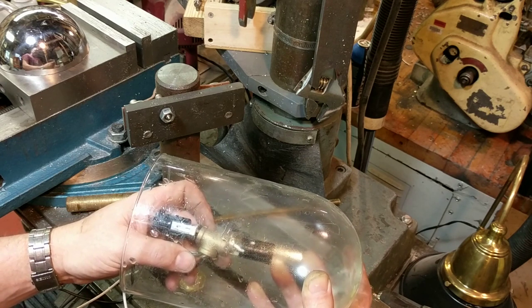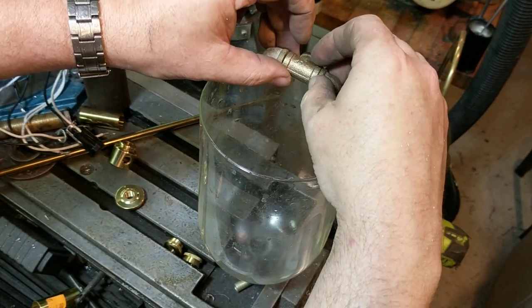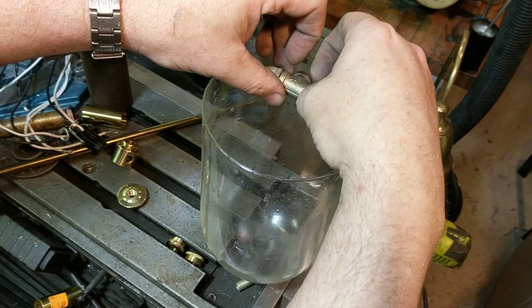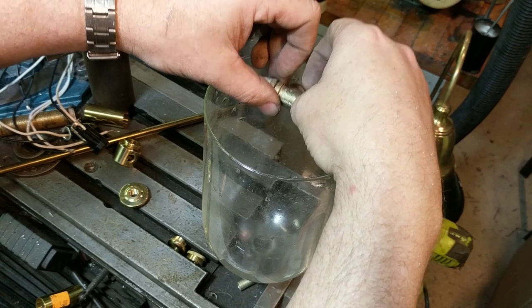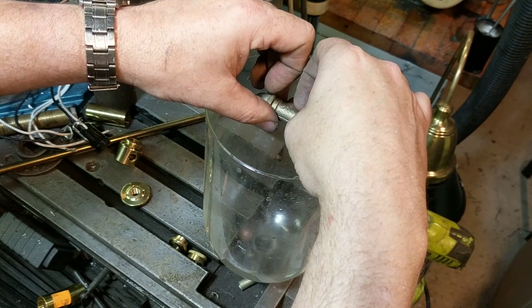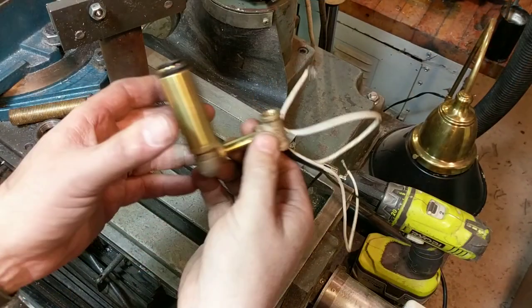I found a solution I like - I need a couple of brass close 90s or close nipples to join these L's to this T, and then those two fixtures can both point straight down. They'll be close enough together - not too close, not too far apart - about the right distance for a small bulb to hang in this fixture. I'll do the brass manifold like I was talking about and mount it at about this height so the bulbs are halfway up the glass dome.